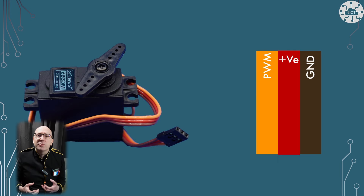These servos have three wires: the brown is ground, the red is the power supply, and orange is the PWM signal. The orange can be connected directly to the Pico onto a pin for PWM. Red should go to 6 volts for the supply for an MG996, but I sometimes cheat and use the USB power supply — I can pick that up from Vbus. Ground should be a common ground.